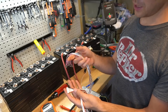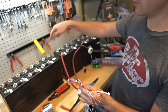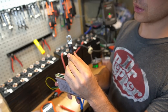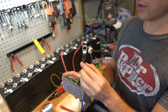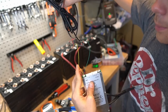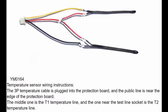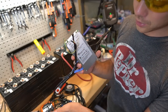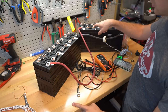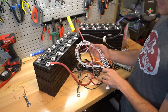The first step in connecting the BMS is connecting the balance leads. I added terminal connectors at the tips and these will go to each individual cell. I also added some pure copper lugs — these are for two gauge wire and should handle the current. The next step is connecting the temperature sensor leads to the two temperature sensors. Before connecting the two battery packs together I noticed they were off by a bit, so I connected them in parallel first.